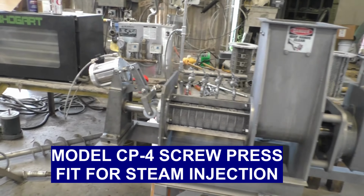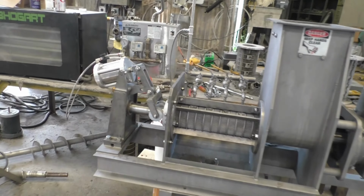We're going to have immense pressure on the cone. Normally you run at 30, 60 psi. We've got a booster to get it up to 200 psi. Running slow, 10 RPM. Here's our cranberries heating. And right here's our boiler.